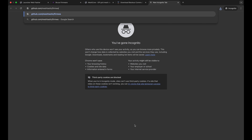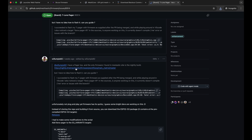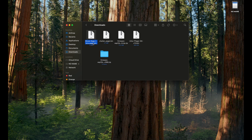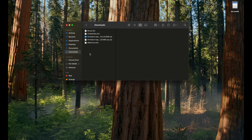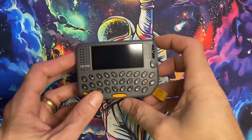Lastly, go to github.com/meshtastic/firmware, go to Issues and search for 'pager'. Go to the bottom result, scroll down then back up a bit — I want to show you where I found it — it's the nightly builds. Search for 'pager' and download the zip. Now plug the micro SD into the computer. Unzip the Meshtastic file and rename the files: Bruce.bin, MeshCore, Chatterbox, and inside the firmware zip rename the bin file Meshtastic. Copy all four bin files to the micro SD and eject it.